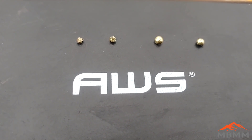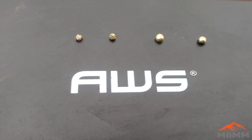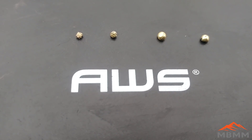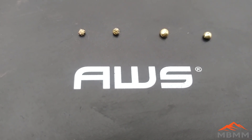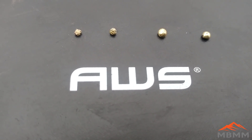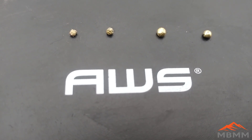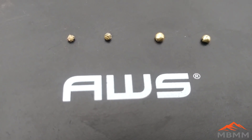There we have it. The one on the left is the borax with sulfides. The second one is the Chapman's flux with sulfides. The third and largest one is the Chapman flux with roasted sulfides — we oxidized them all. The one on the far right is the soda iron method, where we didn't roast them, but we didn't end up with a mat. What we proved today is that mat is bad, and if you can oxidize the material or absorb the sulfide as an iron sulfide and remove the mat, that's the way to go. We recovered almost three times more gold when we didn't have mat than when we did. Hope you guys enjoyed the video — thanks for watching and we'll see you on the next one.